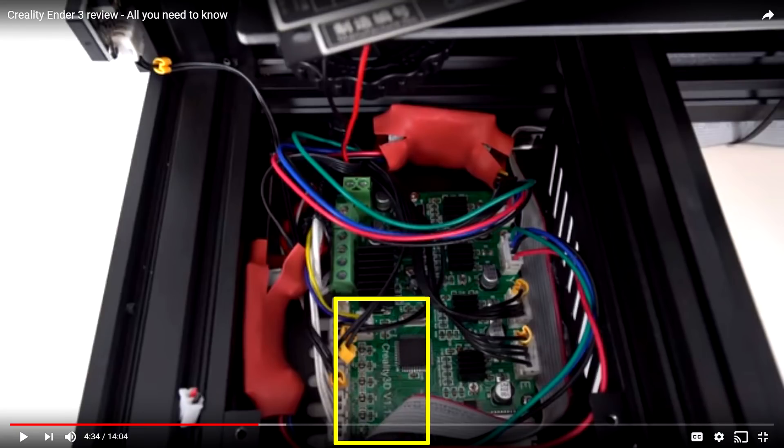Conclusion — well, I don't really know what to think. My results are different to other people running the exact same mod, so I'm scratching my head trying to work out what's happened. A couple of possibilities: there are a couple of different versions of the boards — I'm running a 1.1.3 and I can't quite see in Nexitec's video what version he's running. I've updated my firmware to the unified Marlin firmware from TH3D, and Grant Peck said he's running the standard firmware, though it should make no difference. It's possible there are some variants in the different TL smoothers out there, but apart from the number of diodes they're a very simple device, so the potential for variation shouldn't really be there. All I can really conclude is that the results are inconsistent.